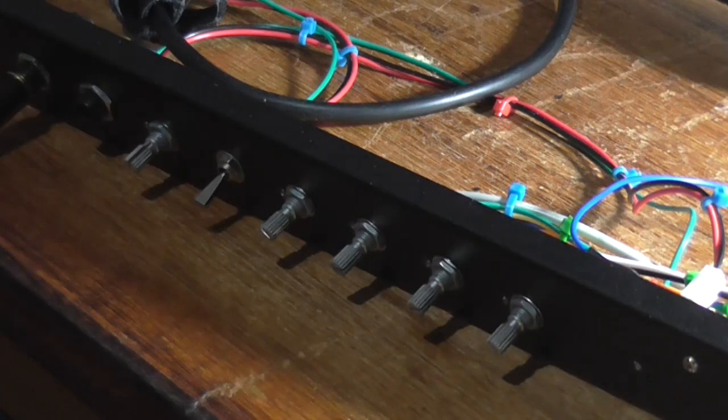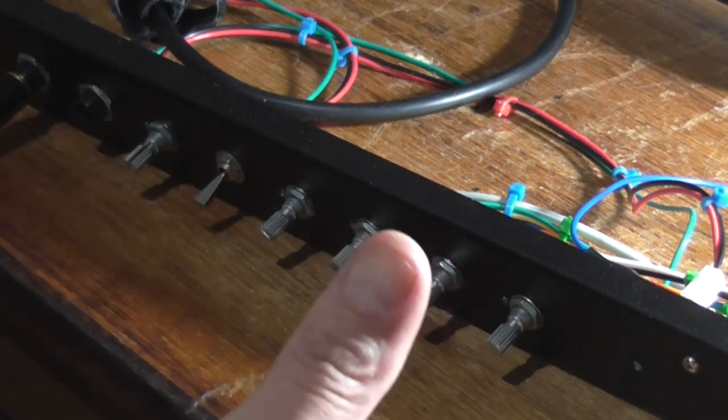Yeah, revision B at the moment, so revision C, and add an extra capacitor on the output of the potentiometer before the output buffer's input. Or else, yeah, you get some nasty distortion at the bottom end, or fully anti-clockwise position, and the control is very touchy. Now it seems to be functioning a lot better than it was, so I am happy.